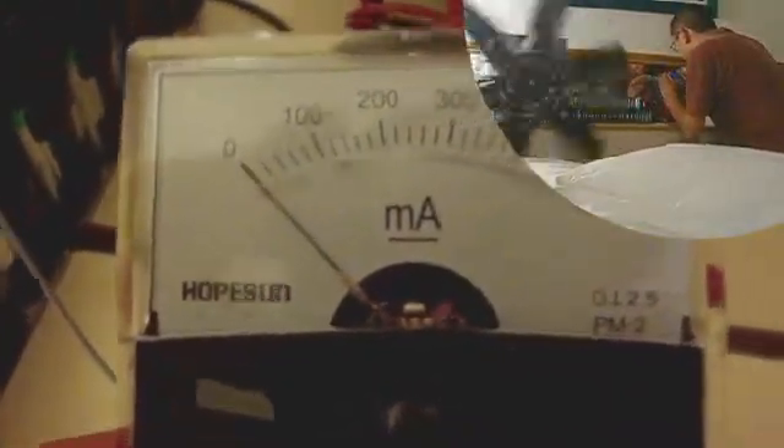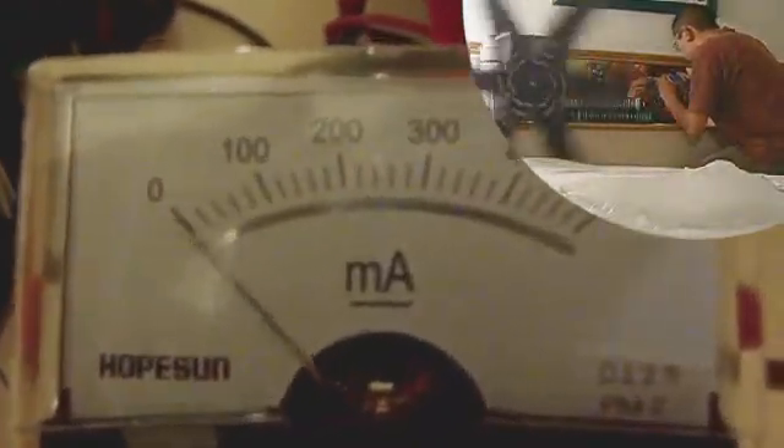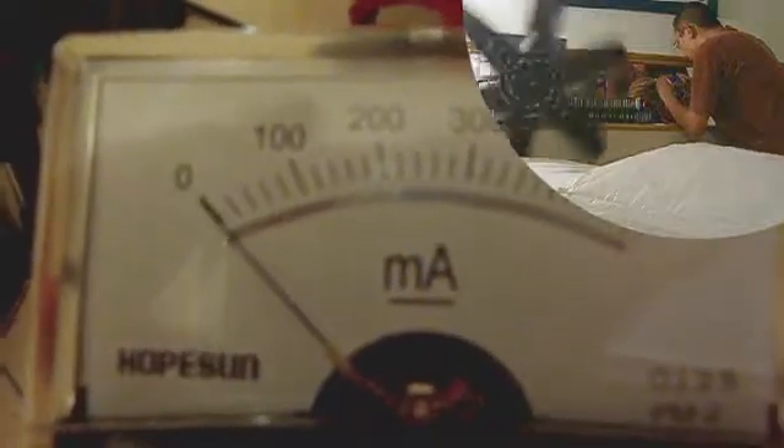Now we disconnect. We would have to go all the way over there to see a gap. As it speeds up, from this angle we already see a gap — over here the gap is greater obviously. But when we remove the prong, there's no gap; we have to move it all the way before we see one. So we know that even the analog meter is picking up the negative spikes.